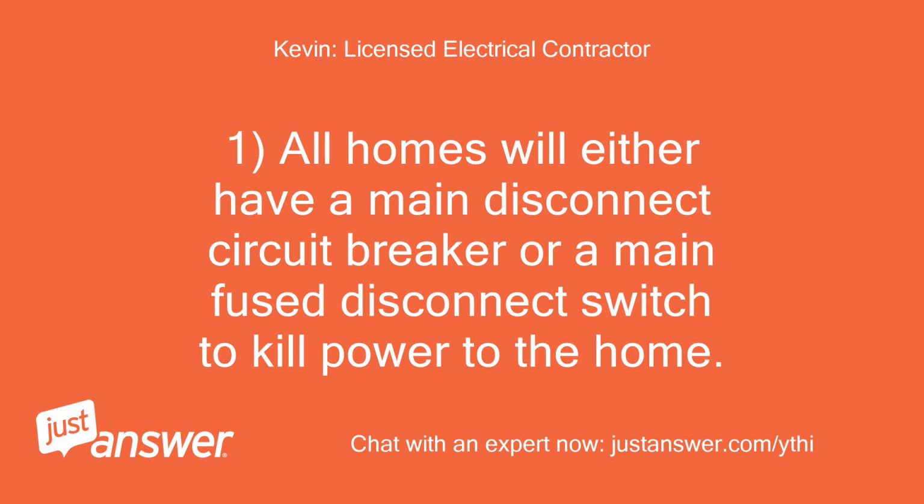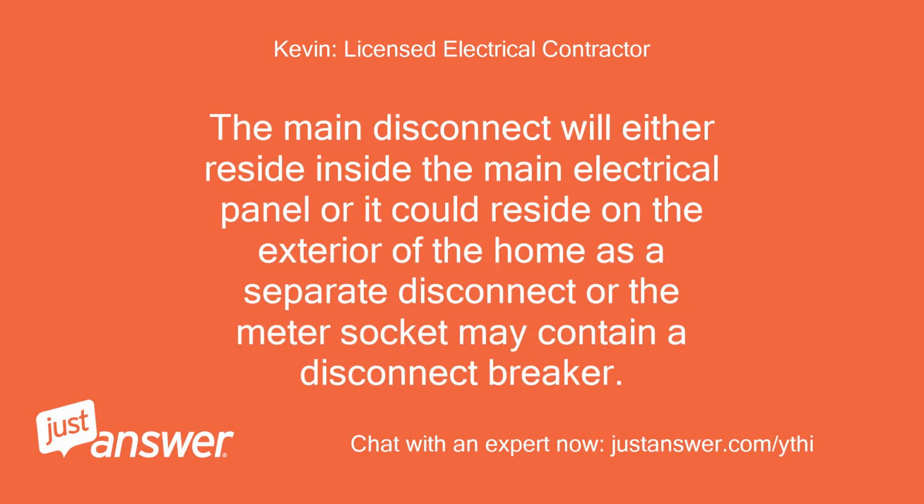1. All homes will either have a main disconnect circuit breaker or a main fuse disconnect switch to kill power to the home. The main disconnect will either reside inside the main electrical panel or it could reside on the exterior of the home as a separate disconnect, or the meter socket may contain a disconnect breaker.